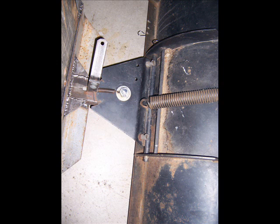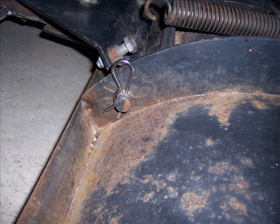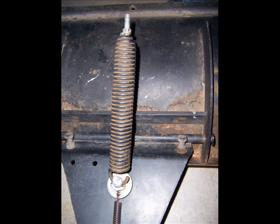There's the blade. I slip it over the rod on one end, bring it over, slip it over the rod on the other end, and attach two hairpin clips — one on each side of the blade. Here's the left side of the blade, and here's the right side attaching the hairpin clips. That's all that holds the blade on there aside from the spring. There are the blade stops so you can tip the blade completely back and it stops — that's not a function of spring tension. The next thing is to slip the spring through the main pivot bolts and then stick the spring bolt up through the top of the blade and tighten it down.